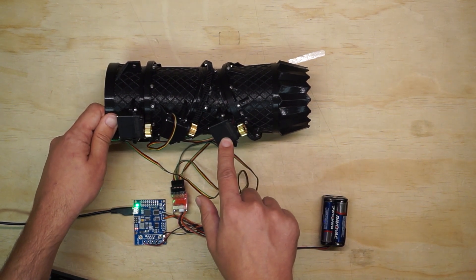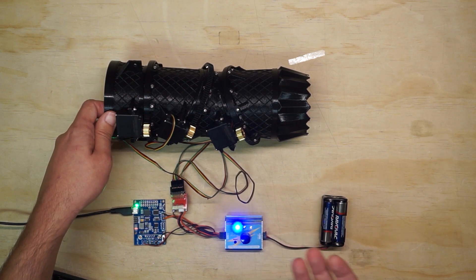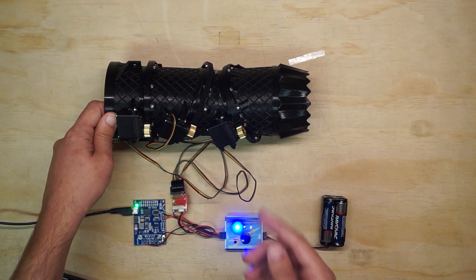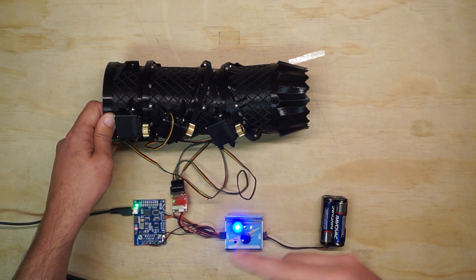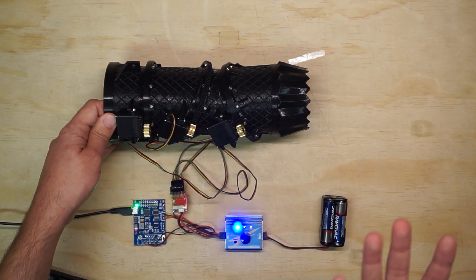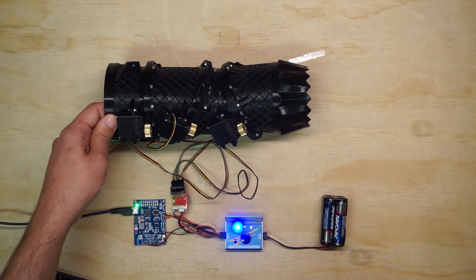This isn't UAV CAN, which some people will probably ask about. UAV CAN is a version of CAN bus that's becoming really popular on flight controllers and autopilots nowadays — ArduPilot supports it, along with a handful of peripherals. While the HiTec servos do support UAV CAN, there currently aren't UAV CAN messages that allow me to get the multiple-rotation with proportional feedback performance that I need. So for now they're just running CAN 2.0. In the future, if the UAV CAN protocol expands to include that, or if we do a custom servo firmware, that might change.